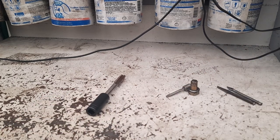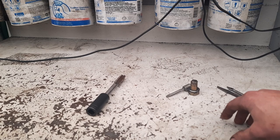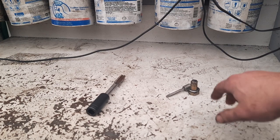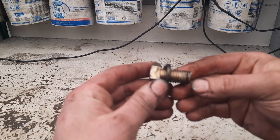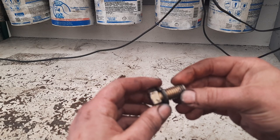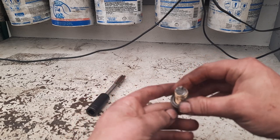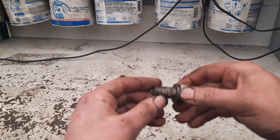At the end of the day on the same truck, I got the side mounts on. What I call the three bolts — basically the bolts that hold the connection from the frame mounts to the transmission mounts. Running the bolt in, it's a grade eight fastener. Here's the original bolt that was in it, and it didn't feel right. I ran it down, gave it a few ugga-duggas, and could feel something was off. As soon as I went to take it off, it sheared off flush into the lower block on the frame mount — not ideal.